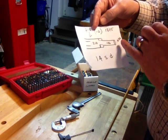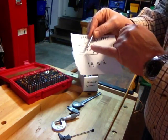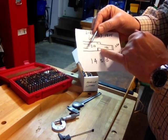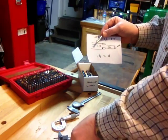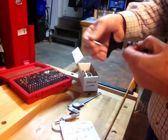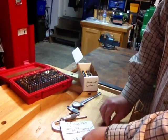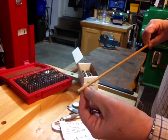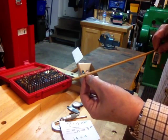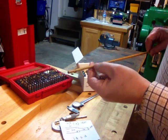So we're just going to have to touch them down with a file to get them to fit. The other thing to notice is that the smaller diameter step on the bamboo rod is not just this distance — it's this distance plus some more. I had to measure it to find out what the step is, and the big step only goes down that far. So I've measured everything out on the rod: the small step is going to be a 12, the big step a 14, and then the mini step for the ferrule tabs is about 5/16 of an inch.